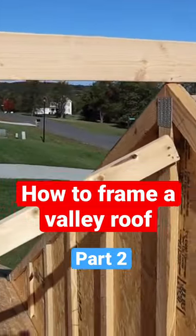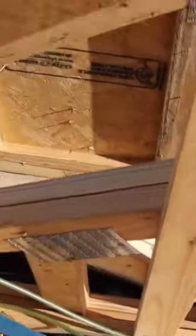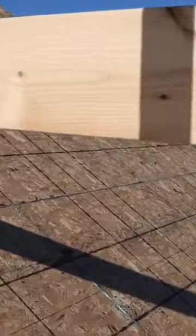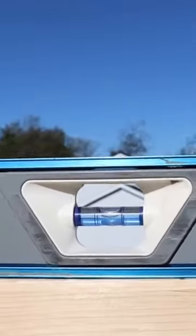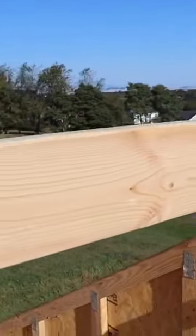What you need to do is just lay a board up here, just like you see here. Take your level and keep sliding it up or down the roof until you get it nice and level. Now you can see we got our roof nice and level, and after you do that you need to make sure that this board is square with this gable truss.